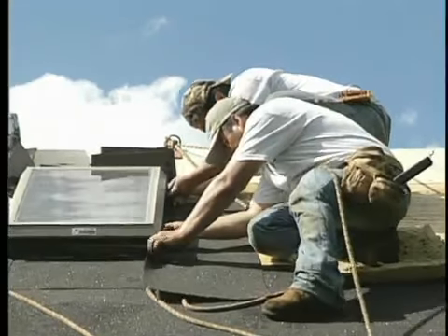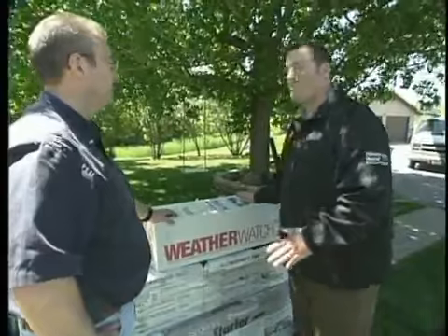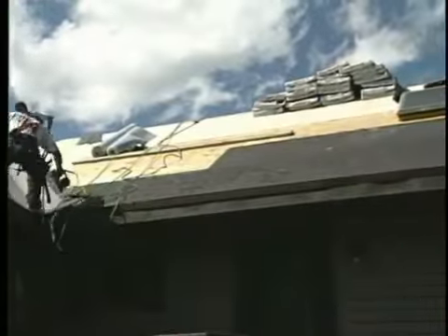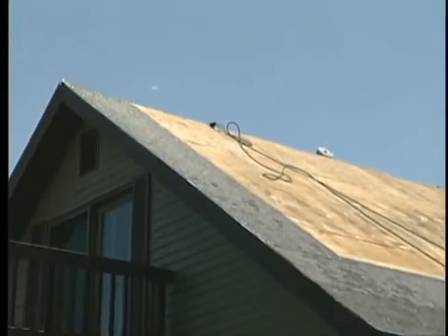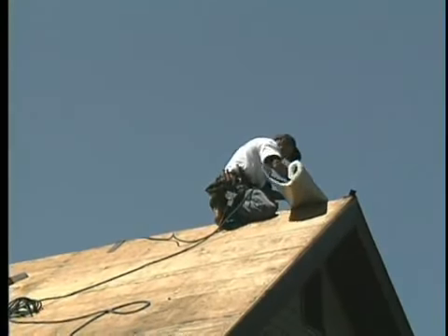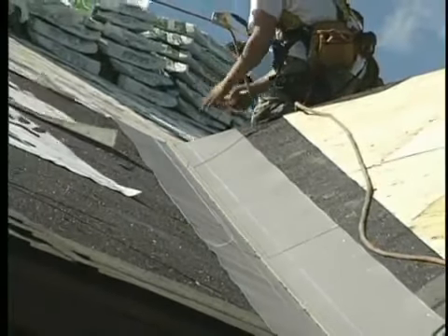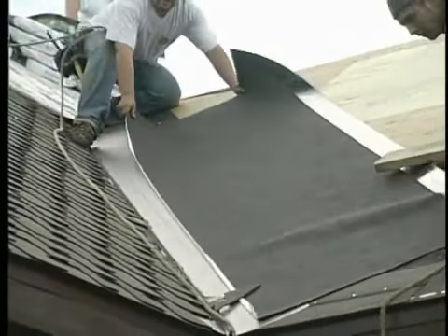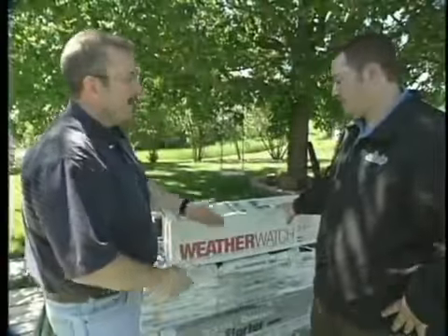So where are you putting the WeatherWatch on this roof? There are a couple of different ways of looking at that — what's required by code and what we do for our GAF warranty. Required by code is just along the rakes and up the valleys. What we actually want to do is go four feet past the interior wall with the ice and water shield, up the rakes, along the hip or ridge, and then one row down the middle of a valley. Then we put a piece of valley tin over the top of it, with one row on each side, to ensure absolutely no leaking anywhere on the house. So you have essentially a triple layer of protection in that valley — between the two layers of leak barrier and the valley tin — that's never going to leak.